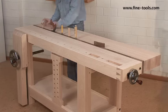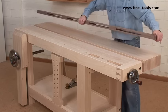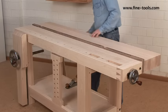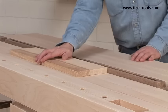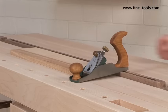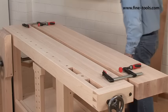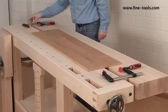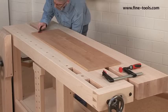If you turn the board over in the benchtop slot, it sticks up about 50 mm above the benchtop. The projecting edge can then be used as a planing or saw stop, or simply to set hand planes so that their irons do not mar the benchtop. If you take the board completely out of the slot, this allows you many possibilities in terms of solidly clamping workpieces and various kinds of jigs and bench accessories to the top.